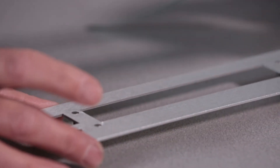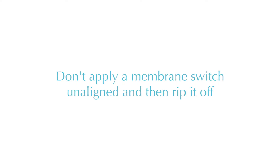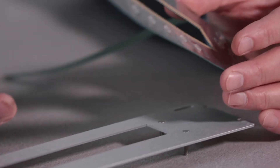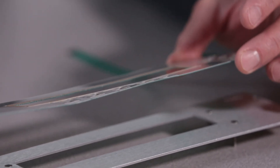One last piece of advice when applying a membrane switch to your substrate — whether it be a metal panel, your housing, or the product itself — is that you don't ever want to put it on unaligned or crooked and immediately rip it off to try and realign it. That pull and removal once it's been adhered to your substrate will pull the metal dome past bottom and ultimately invert or oil-can it, rendering it useless or certainly reducing its longevity over time.